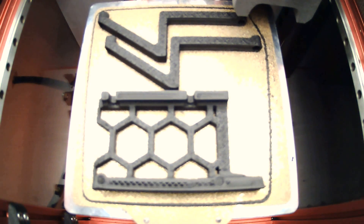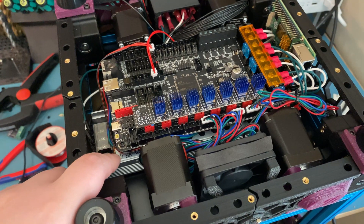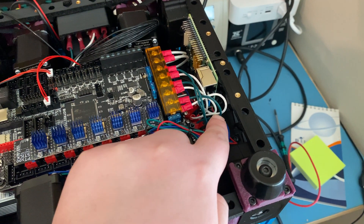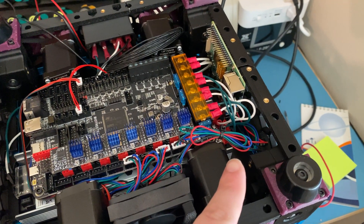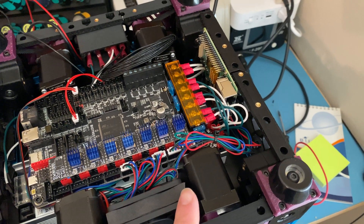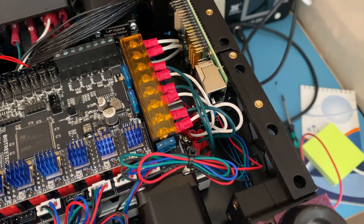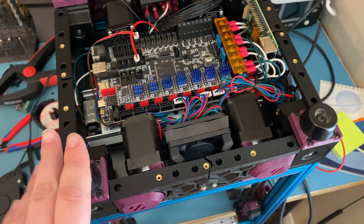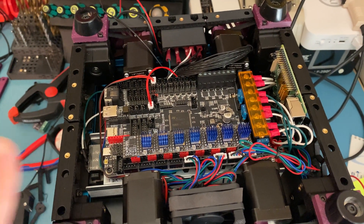Here is the new electronics setup — pretty much the same idea: power supply on the bottom, Octopus on top, and the Raspberry Pi on the side so I can access the USB ports for things like a webcam. It's not needed for the Octopus connection since the Octopus and Raspberry Pi will connect through the GPIO pins. I'll likely use UART for that. Power to the Raspberry Pi will run through the GPIO as well, which is why I don't need a USB power board on the other side.